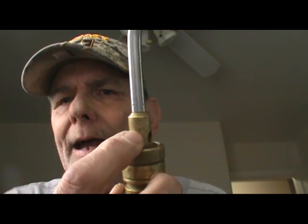This is a turbo torch handle. That's an A8. And that's the proper tip to use for a refrigerator in a home. Here's the air injection holes. It's called AIR-ACETYLENE. Air. Not oxygen. It's air. It sucks it in and mixes and causes a swirling at the tip, which creates that swirling around the copper, so then it actually flows the solder at the proper temperature, not 3,000 to 6,000 degrees, which is oxy-acetylene.